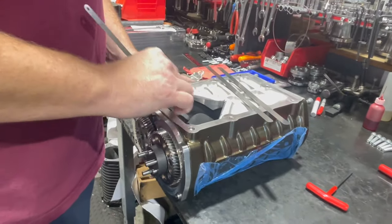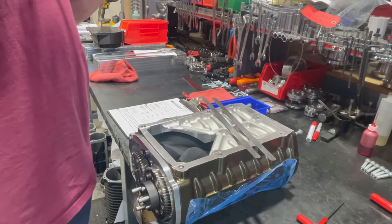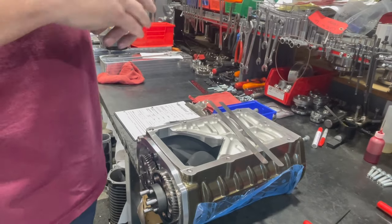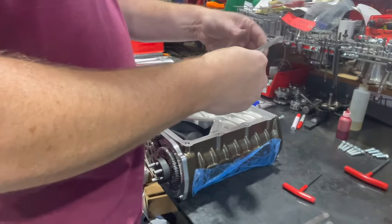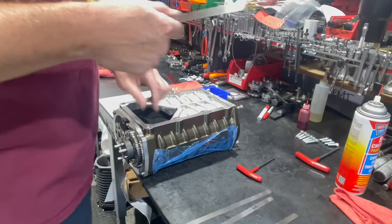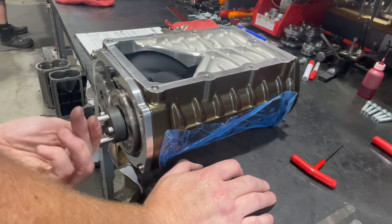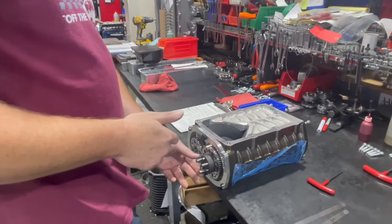And what's the black coating? This is an abradable coating. Abradable? Yeah, so what happens is in the initial wear in, it'll swipe off anything where it's making contact. And then after that, it's just go. It basically self-levels itself for the most part. Hear that faint sound? That's just where they're barely sweeping. And that's a good thing.